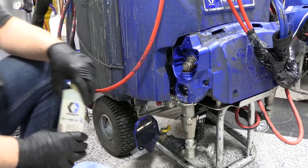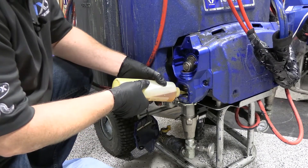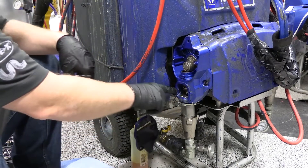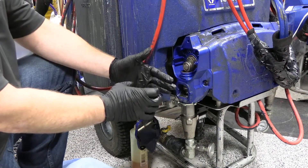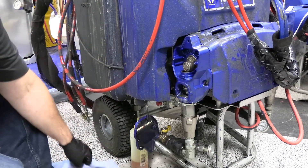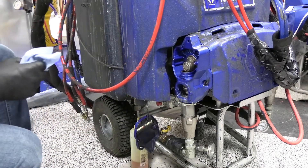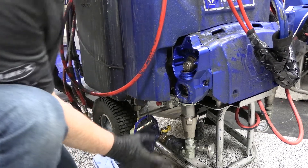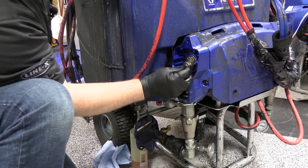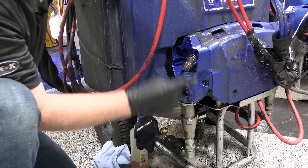Now that I've got everything tightened up and everything's back, I'm going to put some more oil on the shaft. There is a little gap between the actual shaft and that black housing — kind of like a wet cup. You just want to fill that up and let that oil set in there. If a little runs out, no big deal. It's just going to coat that so that if any ISO does come out, it's not going to stick. Once you've got that, put your cover back on. Don't forget the magnet — it goes on the crank, anywhere, it doesn't really matter, but put it to the outside. Don't set it in the middle. It has to sense that it's going around.